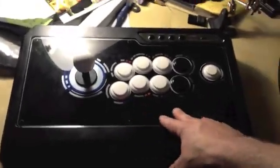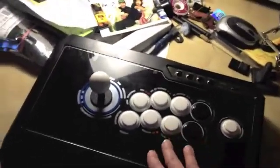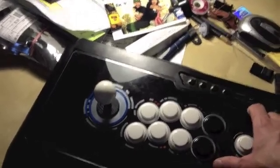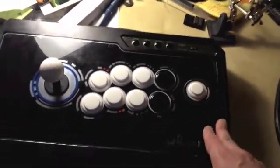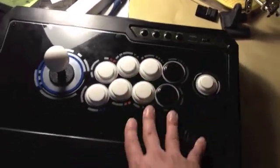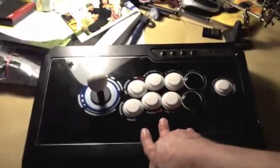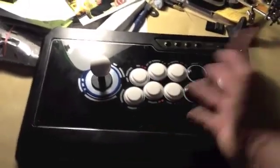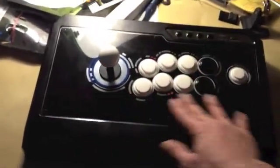I'm going to check inside to see how it's made. As you know, I struggle to make my own joystick arcade PCB work with the PS3. This device works on both PS3 and Xbox 360, which means they have a way to interface with the Xbox. The USB protocol for devices on the Xbox is encrypted, so you can't put any standard joystick on it. It works on the PS3 because the PS3 accepts any standard USB joystick device.